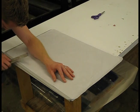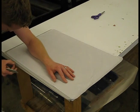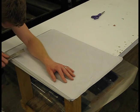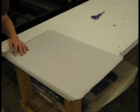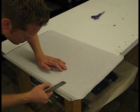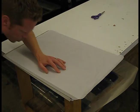Go over and make sure you inspect all the edges, especially the ones you cut on, and get that burr completely off. You might want to feel with your fingernail along that edge — just run it from the inside of the plate out towards the outside and see if it catches there. If you have a ridge still, sometimes you can file it and it will take off the burr a little bit but just make a blunt raised area, so make sure that you feel that and really got rid of it.